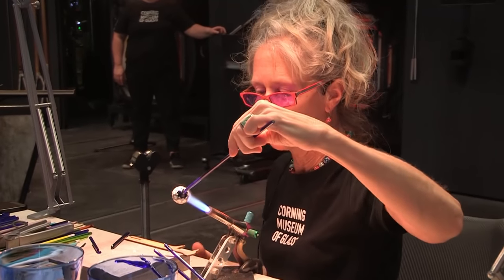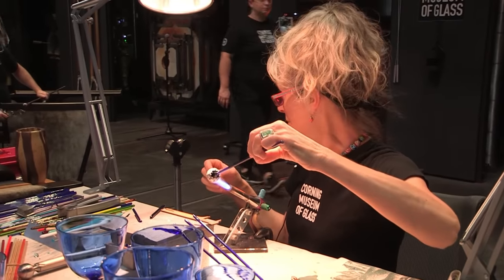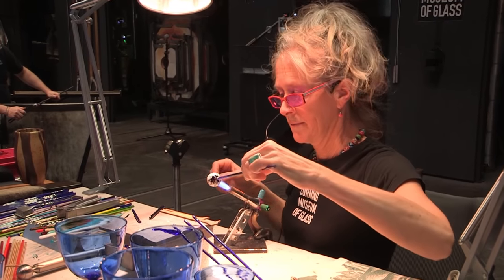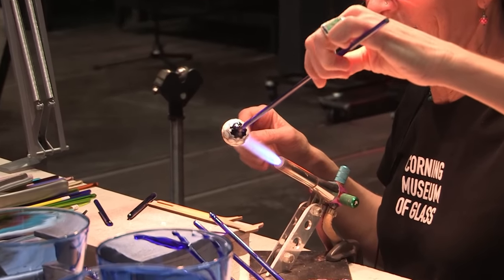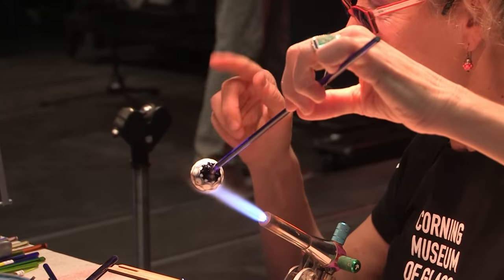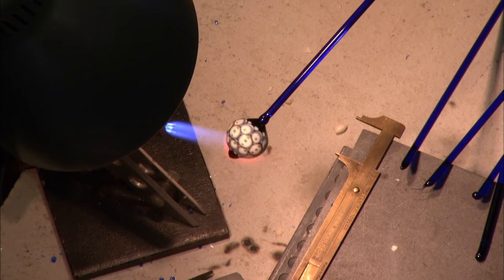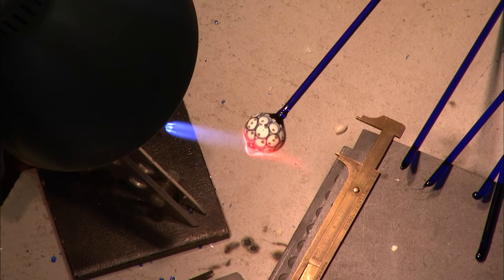Right now I'm trying to give them the beads in the position that they want, whether I am attached to the top of the bead or the bottom of the bead, so that they can then take them and put them together at the furnace. And Kristina, the glass you're holding onto is essentially your blowpipe or punty, right? It is. I'm not using beautiful punties that break off when I tap them. These are glued-on handles, let's call it, and I'm just attaching them. They're really tentative, so I have to be careful because this kind of glass is really sensitive to heat shock.